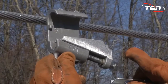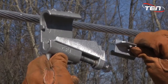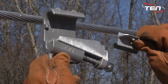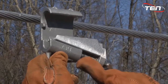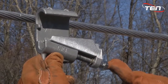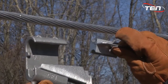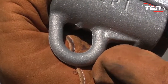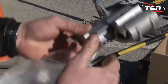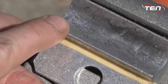This is the Connector Products wedge connector. Out of the packaging you will find two separate pieces for the installation. These consist of the C body and the interface. The C body consists of the body, shear head bolt that will give you the proper torque, and the drive wedge mechanism. The interface is the main connection between the conductors. Both are equipped with hot stick eyes for installation. When you open the package the connector is ready to install as it comes factory installed with grit corrosion inhibitor grease for your application.